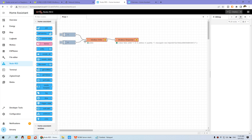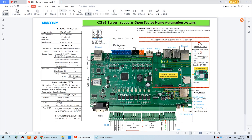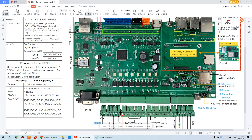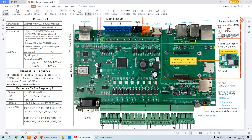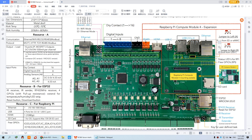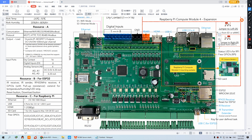Let's look at the hardware details. You can see here we have used the KC868 server. The orange interface is RS-485, and this is the RS-485 interface A and B for the KC system. You can use this to manage all inputs and outputs. This RS-485 is connected to the Raspberry Pi, so it is managed by the Raspberry Pi and by Node-RED. You can use a LAN cable to connect A and B.